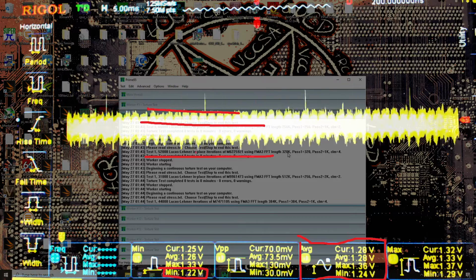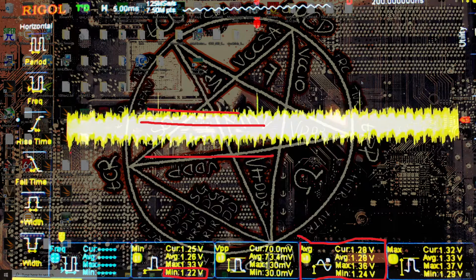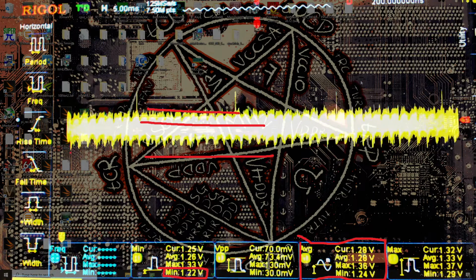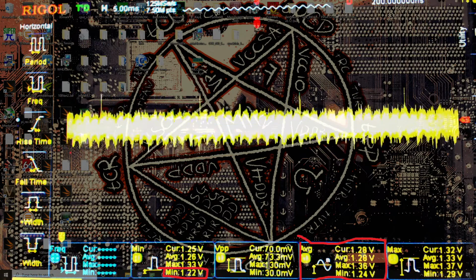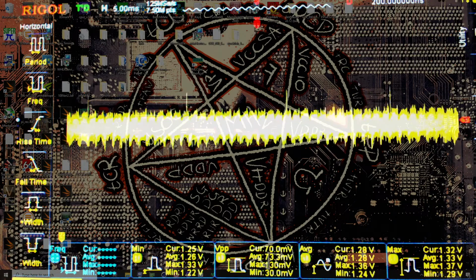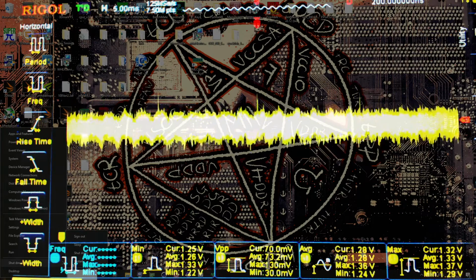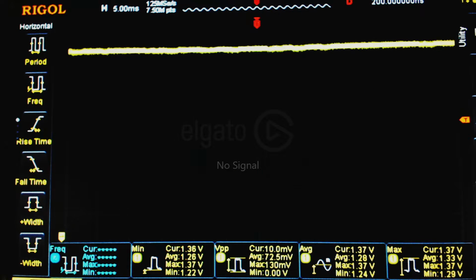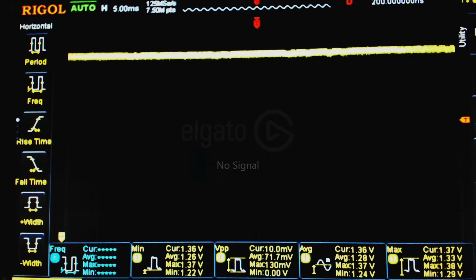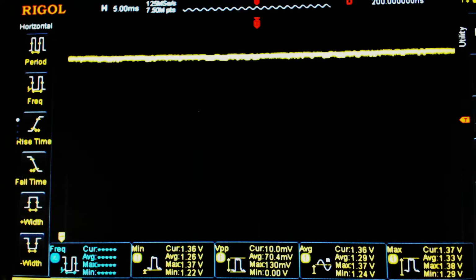So, yeah. Anyway, that's all I wanted to cover in this video. And somehow it's still 33 minutes long. Good job, me. So yeah, if you have one of these MSI Z690 boards that uses the Monolithic Power Systems voltage regulator, mode 3 or mode 4 with 500 kilohertz switching frequency is probably the best settings you can use for static voltages. Probably even for dynamic voltages, but yeah. The 1000 kilohertz setting evidently causes some kind of issue, so I wouldn't use that at all.